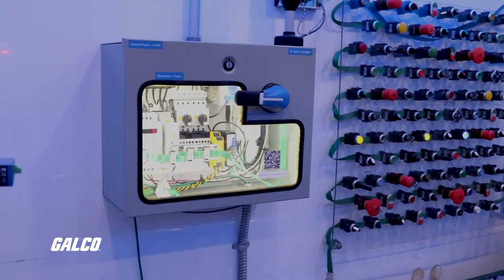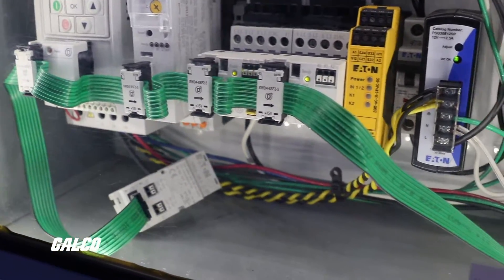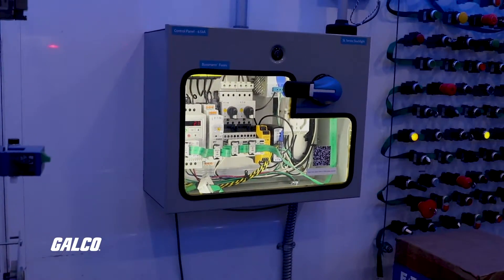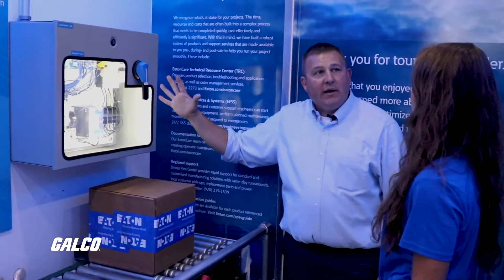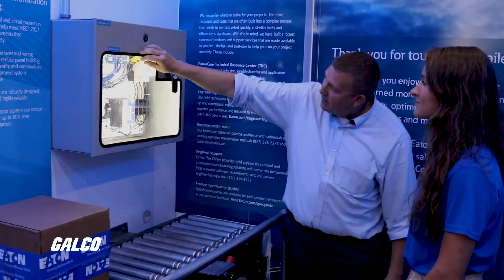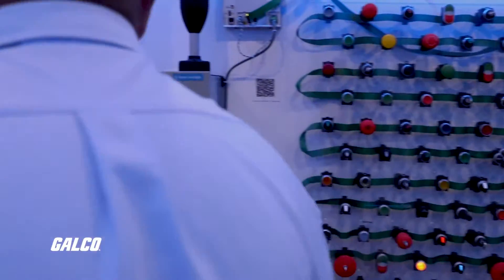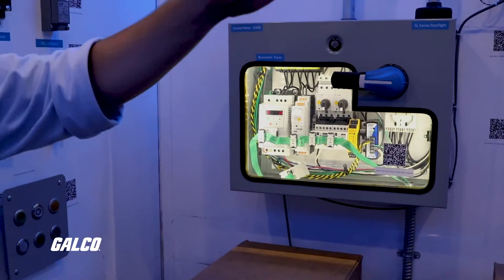This is more near and dear to what we do as an OEM team. What we're showing here is our SmartWire system — the screened cable really stands out. This panel is actually what's running this demo. We made another panel down here to show the comparison. If we were going to do this the traditional way — the way we've been doing it since Thomas Edison — this is what the panel would look like: it has all this blue control wiring in it. But when you come back down here to the SmartWire panel, you have no I/O and no blue wiring, because we're using SmartWire. That's the old way; this is the new way.